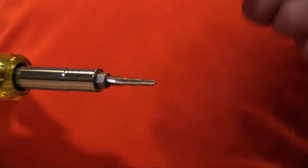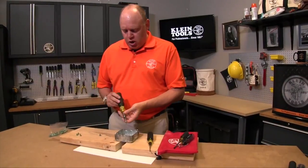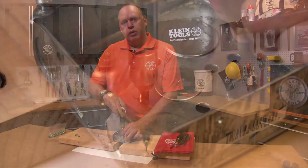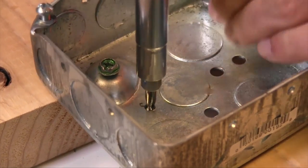The first thing I'm going to do is decide what size I need to tap it to. In this case I'm going to use the 10-32 tap, which is the third tap on this side of the screwdriver. I'm going to go down into the hole and when I feel some resistance I'm going to slowly start turning — as I start turning I can feel it starting to cut the thread.